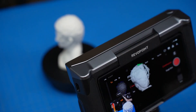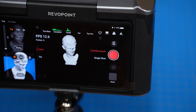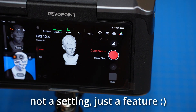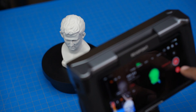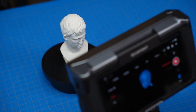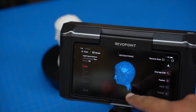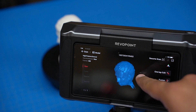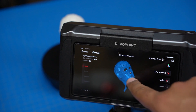I've got Caesar set up on the turntable at maximum speed, and now we can play with the UI. There are more settings hidden in the UI, but the most important in setting up is the histogram, which gives you feedback on whether your object is at the right distance from the sensors. Scanning Caesar went off without a hitch. This is the first scan I've taken on this model, so let's see how that went. Clicking through the first-time-use pop-ups, we can finally see the point cloud that was captured, which overall looks pretty good.